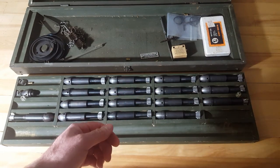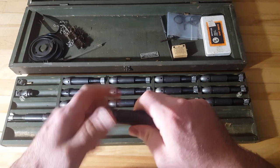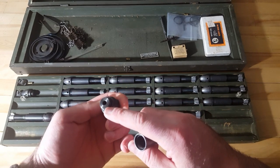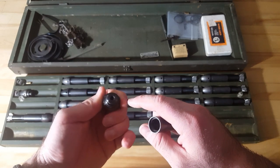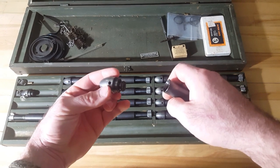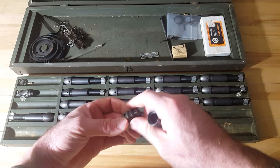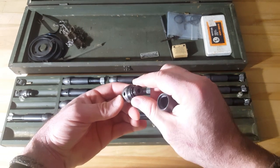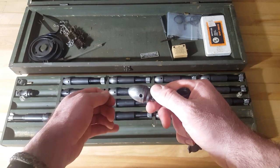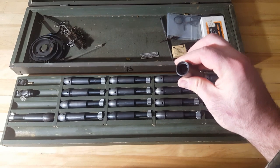It also makes the barrel very easy for maintaining — you just clean it up and that's pretty much it. These come apart in three pieces basically. The front here is where you would put a spotting charge. In my case I use Ramset 22s. I use number 3s just because I bought a box of number 3s and number 2s for the actual launching charge, and I realize that number 2s match that one pretty well. A 22 fits in there and those are the venting holes for it. As you saw in the book, there is basically a weight with a spring keeping it back, much like the bazooka.